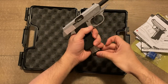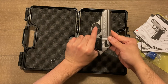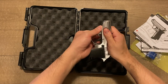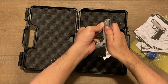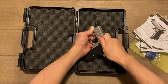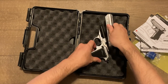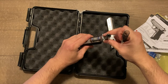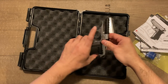You have to actually disengage the magazine if you pull back. Now for the takedown — these are a little different in that you've got a trigger guard that you pull down. Keep in mind this is a spring-loaded rimfire pistol. Pull the trigger guard down, pull the slide back, then lift up and pull forward. Just be careful not to do this too fast or the spring is going to fly all over the place. Pretty easy to disassemble for cleaning. There is a little notch down here where you can reorient the tip so you know where the spring is supposed to be pointing when putting it back together.